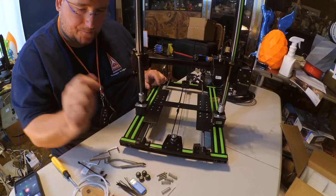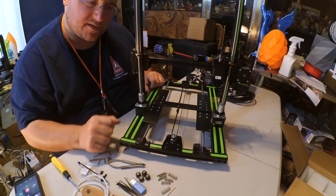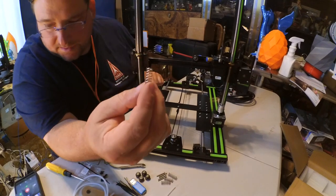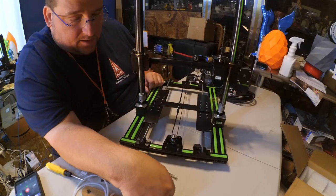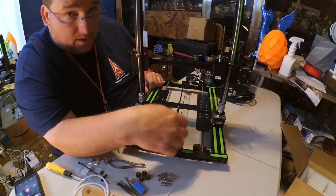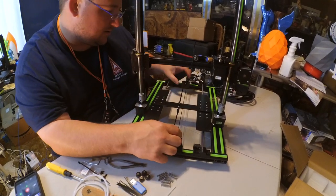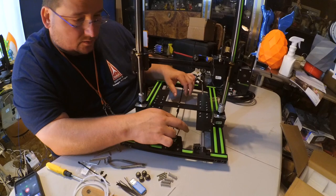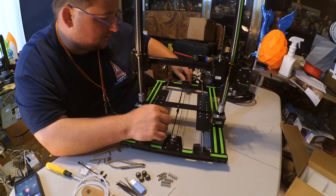These are your screws where your bed hardware goes through. So here's your leveling nuts, your screws, and your springs. These are not the nice flat springs that you see on a CR-10, but again, this is a cheaper alternative to the CR-10. It gives you a larger than normal print volume without paying the $500 premium price of the CR-10. I'll probably tighten this belt up a little bit. That's a little looser than I would like. No big deal. It has a built-in adjustment,